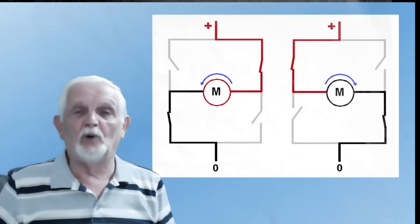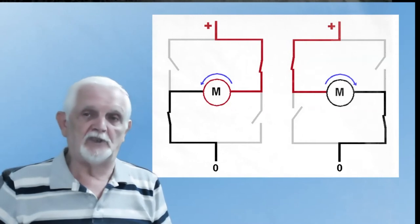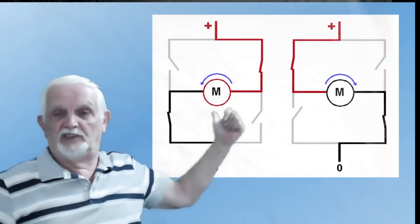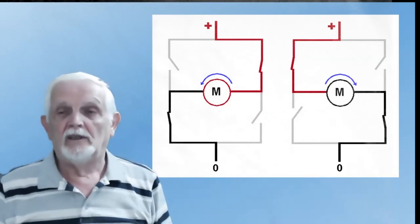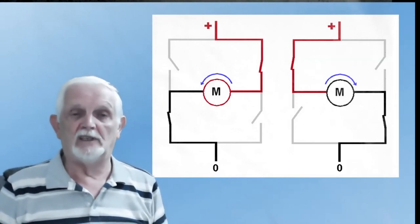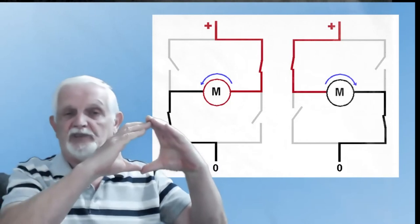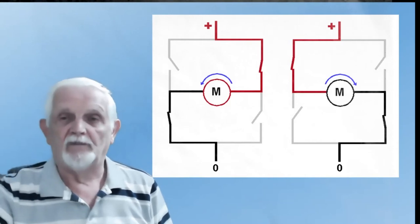In the left hand example, we've operated the right hand switch on top and the left hand switch below, and the motor rotates anti-clockwise. If we switch that off and put the other one on in its place, the motor will rotate in the opposite direction. So we can control direction by using two outputs for a motor rather than just one — putting the motor across two different outputs, and depending on polarity the motor rotates correspondingly.